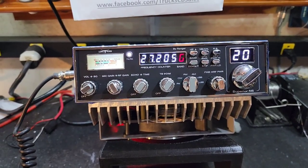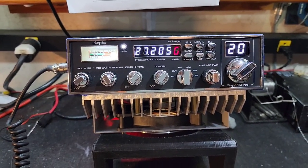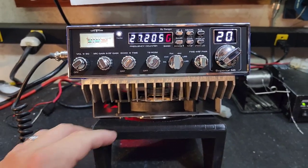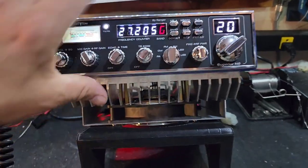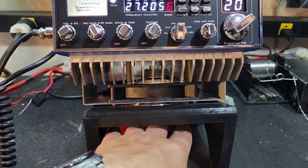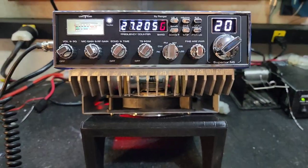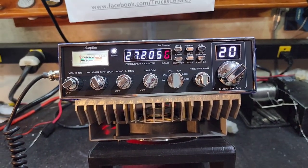Tomas, we got you ready to go. Truckerized tune alignment, voltage regulator upgrade, electrolytic cap upgrades, wideband transmit and receive. You get the fan mod as well as the fan grill mod. Does away with the other type that'll cave in on you there. We just started doing that. This thing's ready to rock and roll. Let's get right to it.